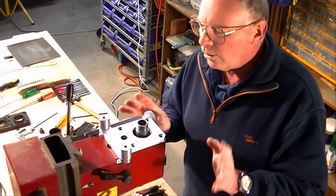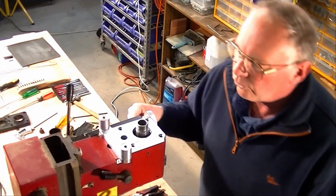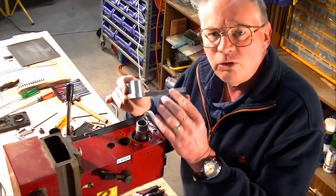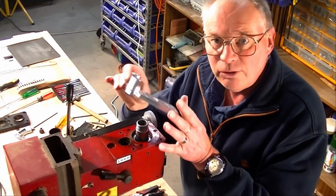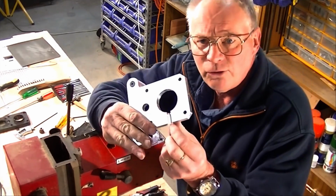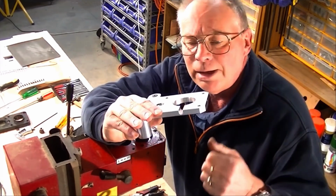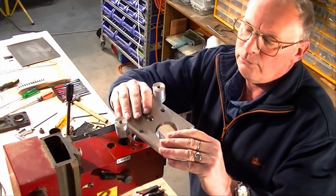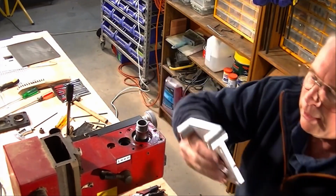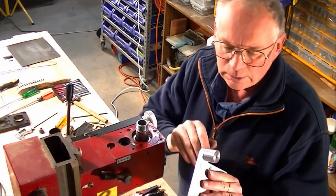Incidentally, now this is the following day from when you last saw this, I said that this is going to be 12mm. There's a good reason for that. I actually forgot to program this into the CNC, so I cut that on my manual milling machine over there, and when I'd finished, it was a bit thin. So that's one reason why I'm going to go to 12mm instead of 9.